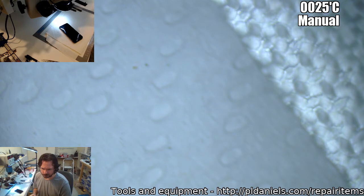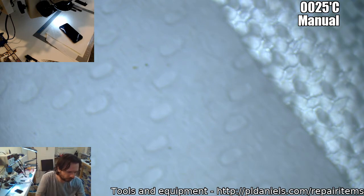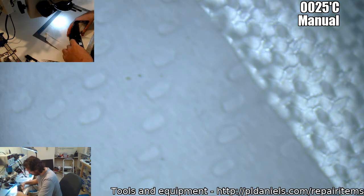Usually means I2C issue, a main power out short, it's low amp. I thought it might be the I2C. I went along and checked all the I2C resistors and rails and things like that, and everything came up okay when I compared to another device. But it's not to say there isn't a problem there. I'll just keep looking, there's no time pressure on me.